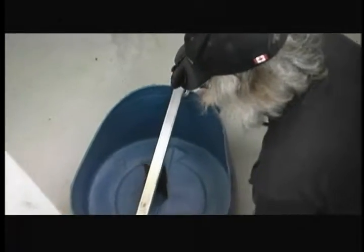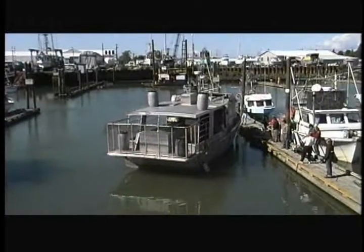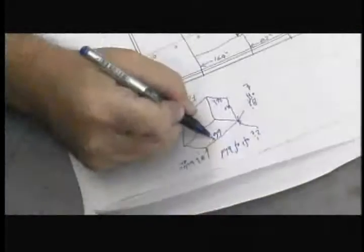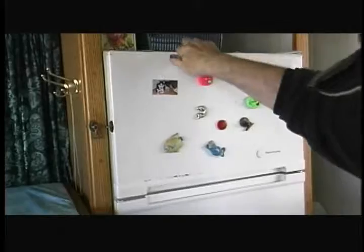When conducting an inclining experiment, a number of conditions must be adhered to. The vessel must be in an upright condition and on an even keel with mooring lines slack. A deadweight survey to identify any weight on board that is not part of the ship is conducted by inspecting all spaces of the vessel. I went around the ship to see what was on board in terms of fuel and water. We identified a little bit of fishing gear on the top deck, but other than fuel and water, this vessel is pretty clean. These weights and their locations are recorded.